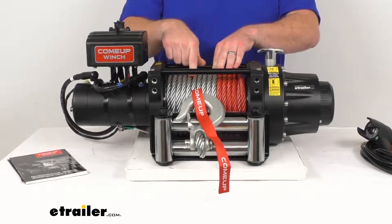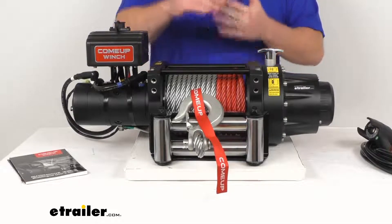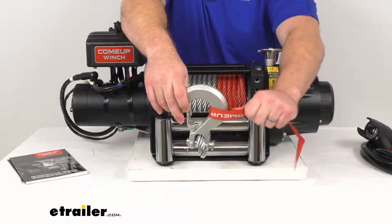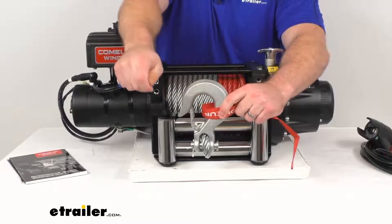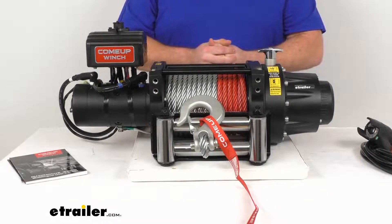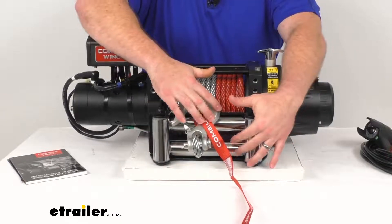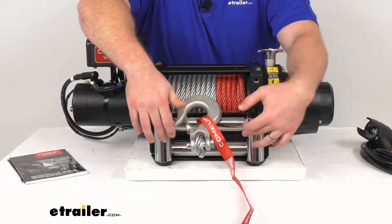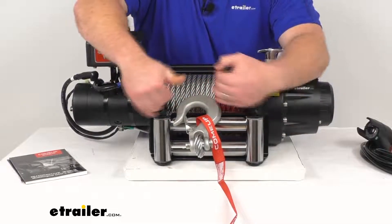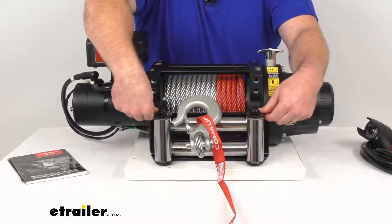The wire rope is a half-inch diameter galvanized steel rope, so it is going to be very strong and abrasion resistant. You're going to have 59 feet to work with. On the end, you do have a half-inch forged steel hook and nylon hand saver strap, so that's going to allow you to easily get hooked up to whatever you're connecting to. You can see the wire rope is going through the steel roller fairlead, which has four rollers to help reduce friction and wear on your rope and prevent binding. It has a nice black oxidized finish to help resist corrosion.